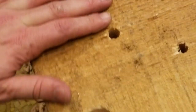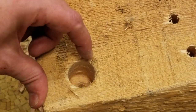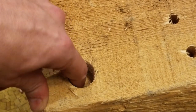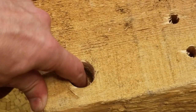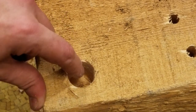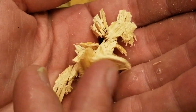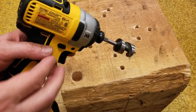Here's a closer look at the hole. You can actually make reasonably flat-bottom holes with these ship augers — as soon as you stop drilling and back it out, the bottom is actually reasonably flat with sometimes just a small burr you can clean out with a wood chisel. The surface is surprisingly decent, though the chips produced suggest the bit is a little blunt and does need some sharpening. But overall, decent performance.